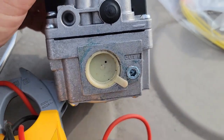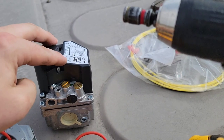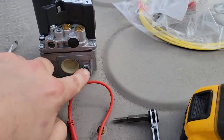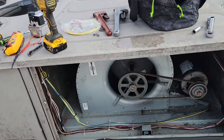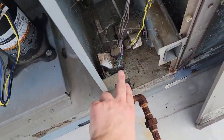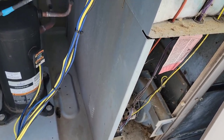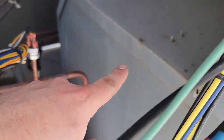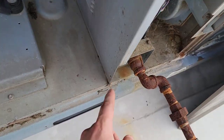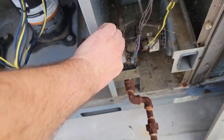Right here is the outlet screw — this is what we need to be hooked up to. Whenever we get voltage to our gas valve, we should have gas coming out of the outlet screw and a pressure reading of around three and a half inches of water column. To measure the pressure, I need to get this panel out of the way. I've already taken out the three screws, and this panel will slide out.